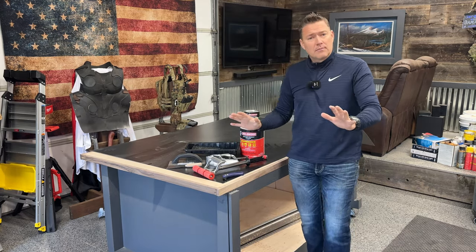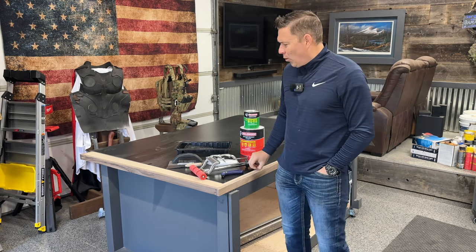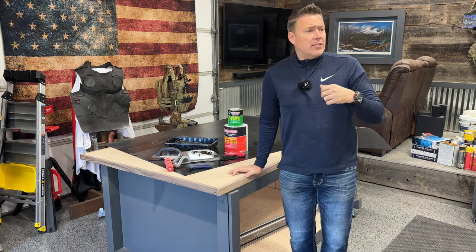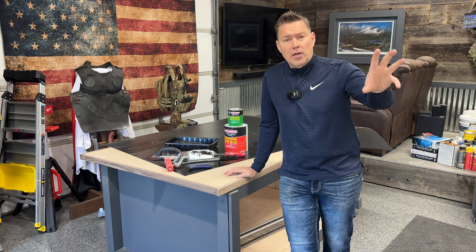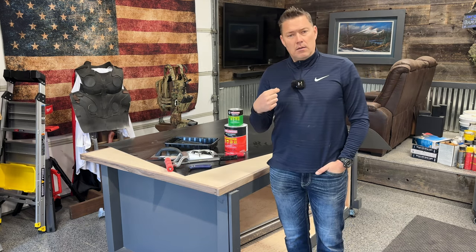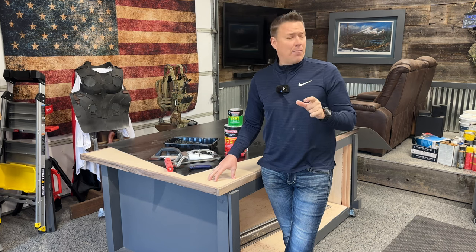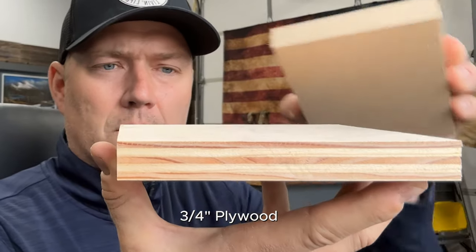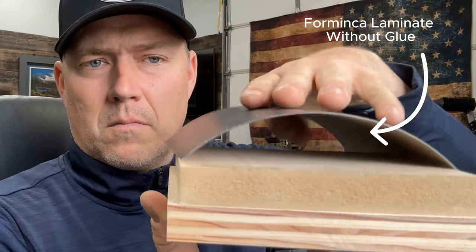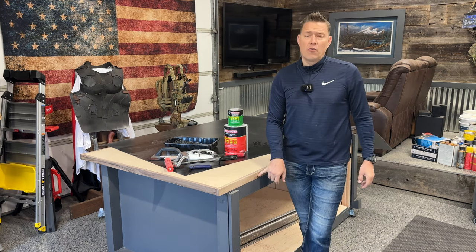So with that being said, these are the tools that you need. I wanted to talk briefly about choosing a substrate. What you'll notice is that mine is a little bit thicker than your average three-quarter inch piece, and that's on purpose. If you're doing this for a kitchen countertop, you can get away with a thinner board. But if you're doing it for a shop top — are you going to be utilizing T-tracks, embedding tracks into this? Then you're going to want to consider going thicker.